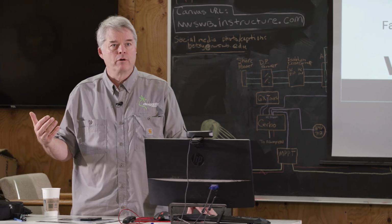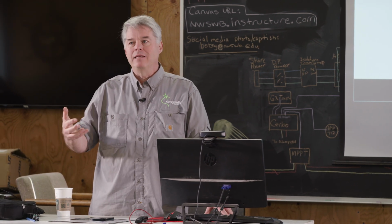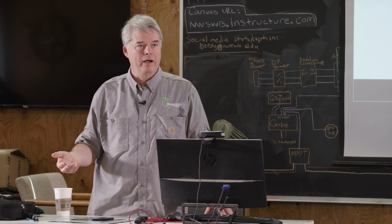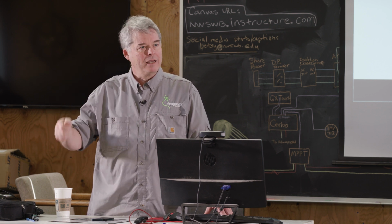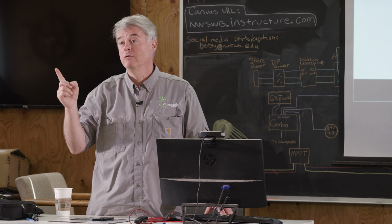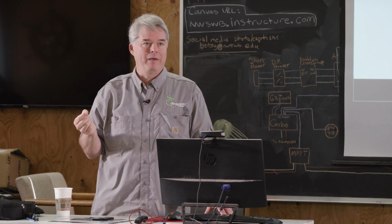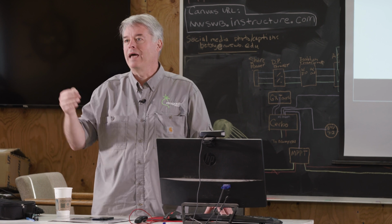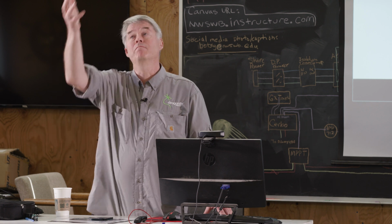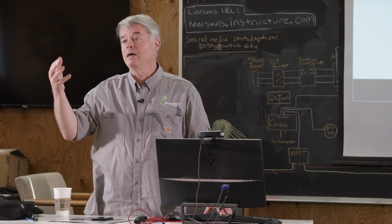Some BMSs will provide an external signal that says, I'm getting upset, stop doing what you're doing. I call it a wiggle wire, a charge enable, charge disable wire. The battery's getting stressed, and before the BMS opens the contactor and opens the charge bus, it will signal out through this wiggle wire to stop doing what you're doing. Case in point, the Victron VE.Bus BMS. That's how that particular product works. That wiggle wire will go inactive, and the Wakespeed will turn off and stop providing charging, and then hopefully the condition will clear. If it continues on because you got some big giant solar panels that were misconfigured, at some point that BMS will pull the ripcord, but we're fortunate because we've already shut stuff down safely, and there's a really good reason for that.